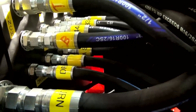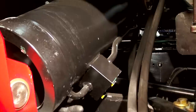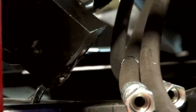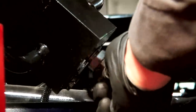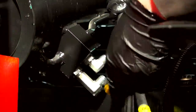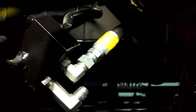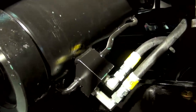Now that we have our bulkhead plate plumbed, we'll start running the hoses to our cylinders. We'll be connecting our lower tilt cylinder — these cylinders have been pressure tested at the factory so they will have fluid in them. When undoing the caps, expect to have some pressure build up. Now we'll connect our 90-degree elbows for the four and six lines off the valve section. You will connect the two 90-degree fittings to your cylinder — there will be a tall fitting and a short fitting. The short fitting is for your number four supply line; the tall fitting is for your number six return line.